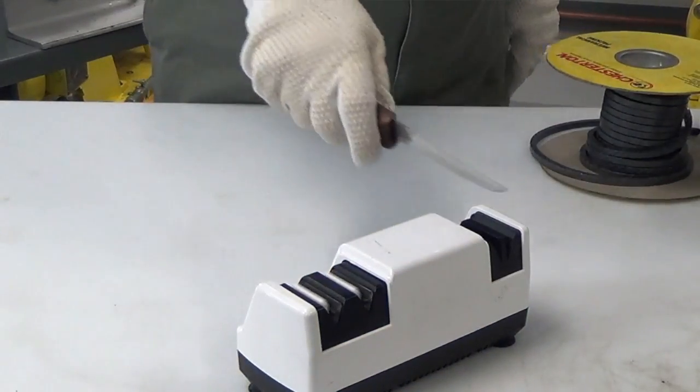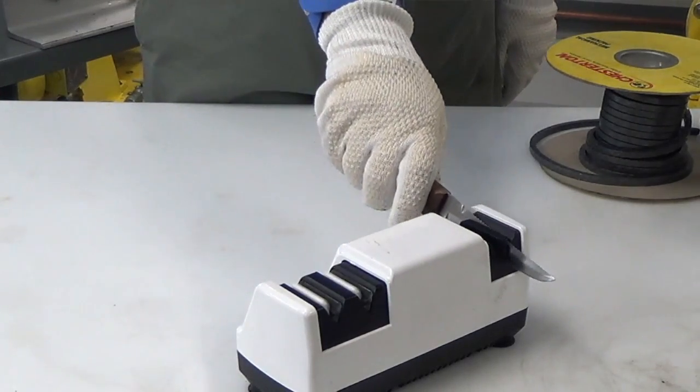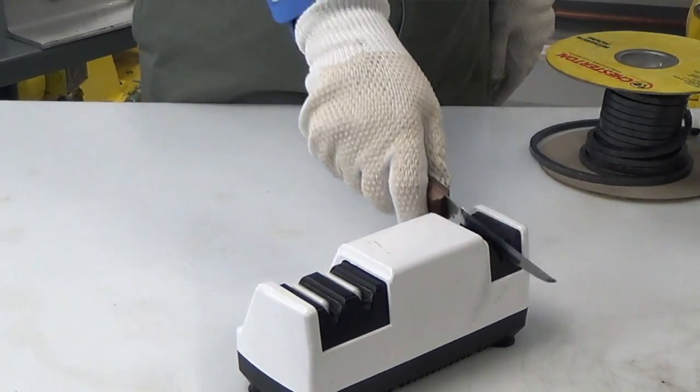The second thing you're going to need is a sharp knife that has been sharpened as often as possible. Having a knife sharpener is crucial because high temperature low E valve packing has a small amount of wire in it, and it just wears the knife really, really fast.